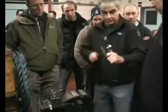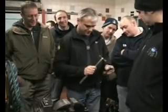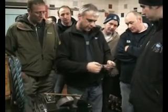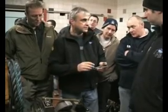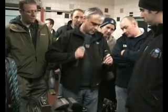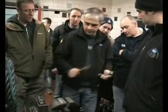These bolts in, but we're going to do it the way you would do it in the shed. The reason being is the ARP bolt is bigger than the diameter here, it's an interference fit. There's a standard one, size for size. So when you push something into something that's wider, it's got to go somewhere.